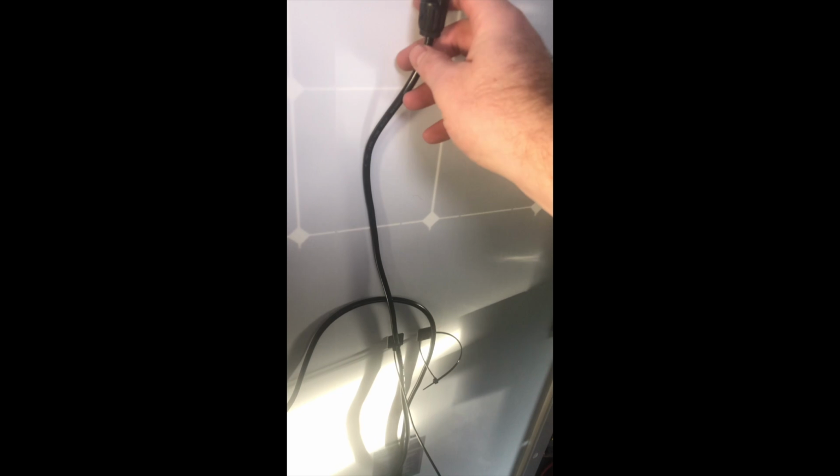So I'm just strapping these up inside now so they don't drop on the bodywork and rattle away on the roof. But as you can see in here now, so excuse the mess. Charge control's wired in. Positive and negative panel, obviously the battery terminal's connected up now. It's still in nighttime mode because the panel's not actually connected yet. And then I'm going to trace all these wires back and then tidy it all up and make sure it's neat and tidy.